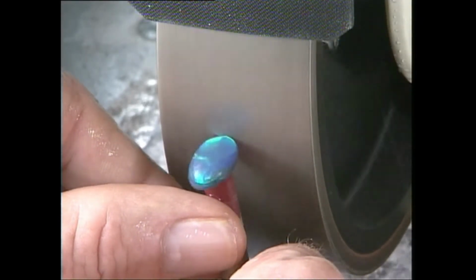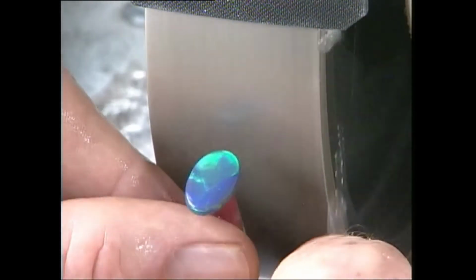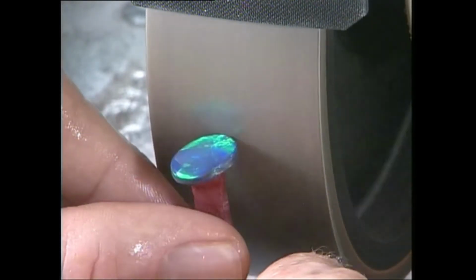Trimming a little bit here and there to bring it into shape. Now if we do cut little bits here and there like that, we have to go back to the spinning process and put everything back into symmetry. Again, cross-hatching to get rid of the spiralling. So a little trim here and there. Final cut has to be the final cut. It has to be a good shape.